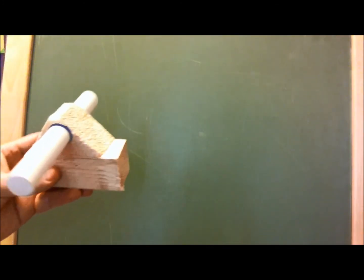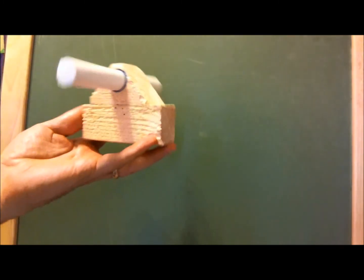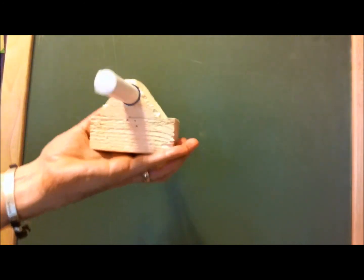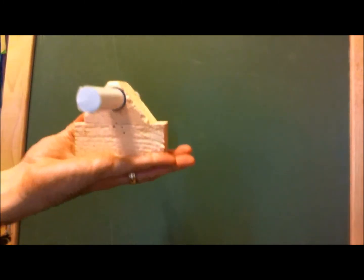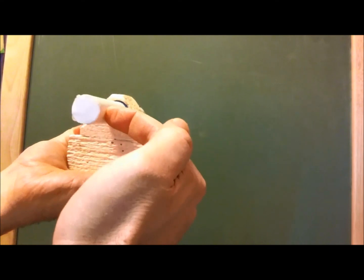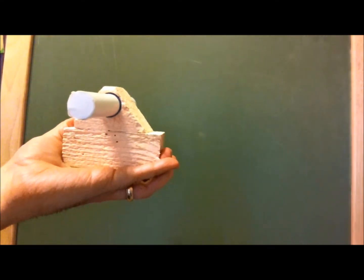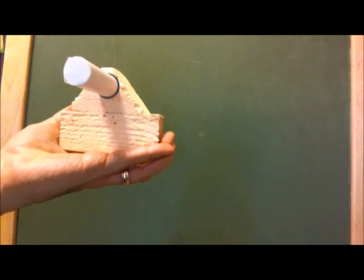In this video, we're going to talk about frictionless pin assemblies or hinge assemblies. And we have two parts as part of the assembly. One is this block, which has a circular element called the pin. And we'll assume for the course of this discussion that this block element is rigidly attached to the earth. So if I put any force acting on this pin, this whole assembly, there's no motion, or if I try to rotate it, this part is immovable, it is fixed.